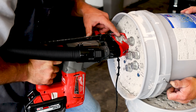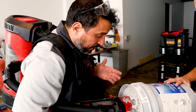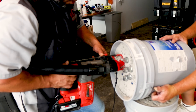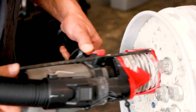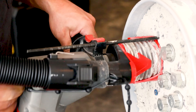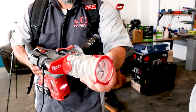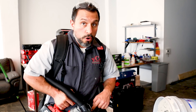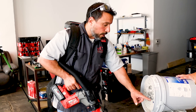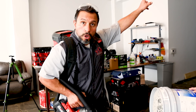Remember, you're going to lose about two inches from the dust trap collapsing, so you might not reach full depth. Also, if you want to set your depth guide, the dust trap will not interfere — say you need three inches, you still set your depth guide normally. You'll see there's no particulate left in here — we have a nice clean hole. I feel like the rotary hammer actually drilled faster because the particulate was being sucked out of the hole as we drilled.